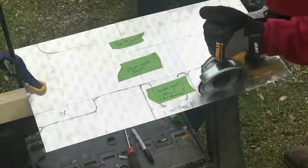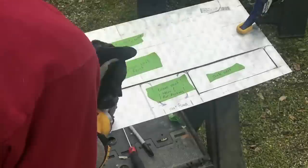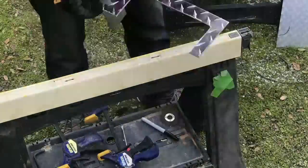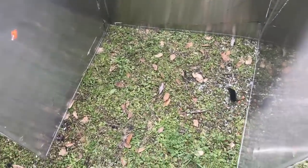The next material I'm using is diamond-plated aluminum, which is going to be a four-inch kick plate along the bottom of my entire cabinet system. I'm cutting it out with my grinder, cleaning up the edges, and then bending it into the shape I want. The next material is this scrap piece of stainless steel — I'm cutting it from an old hood vent and using the natural bend in that corner as the bullnose for the front of my cabinet.